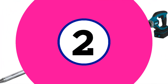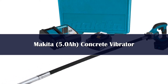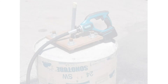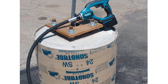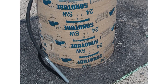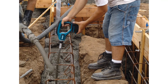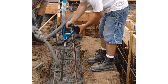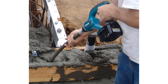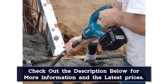Number 2. Similar to my top pick in terms of battery, the Makita XRV01T 18V LXT cordless concrete vibrator kit is a smaller yet powerful lithium-ion cordless tool that spans a shaft length of 4 feet. Its dual-directional switch allows flexible work positions, either horizontally or vertically. It has a speed of 13,000 VPM, which is fair enough for most concrete vibrators. This one is lightweight at only 7.7 pounds including the battery, so it can be used for hours with less likelihood of fatigue. Each charge yields about 41 minutes of runtime under normal circumstances. It has a 1-inch shaft diameter, which is common for concrete vibrators.